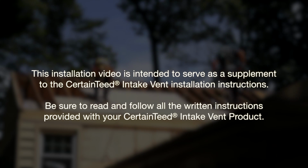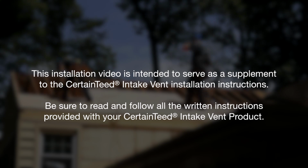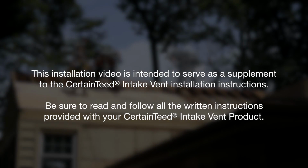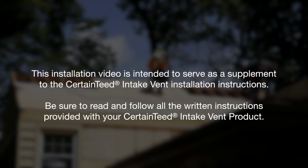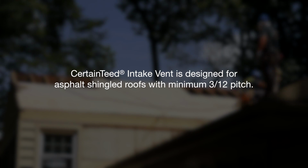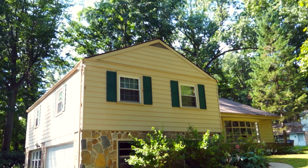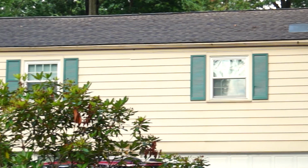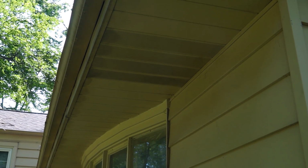This installation video is intended to serve as a supplement to the CertainTeed Intake Vent installation instructions. Be sure to read and follow all the written instructions provided with your CertainTeed Intake Vent product. CertainTeed Intake Vent is designed for asphalt shingled roofs with minimum 3/12 pitch. CertainTeed Intake Vent is designed for installation on roofs with or without overhangs, and it can be placed up the roof with open soffit construction.